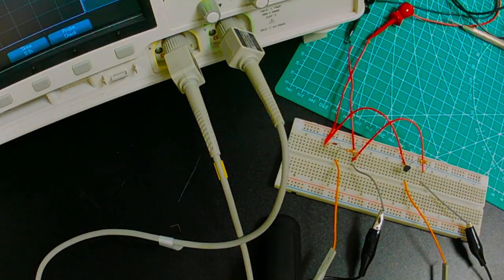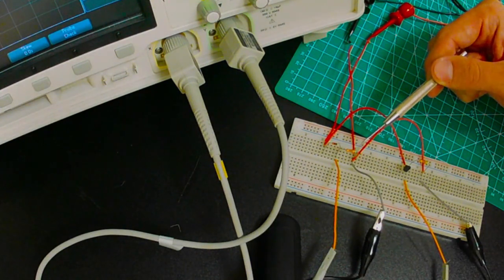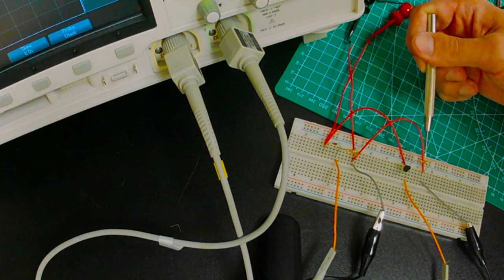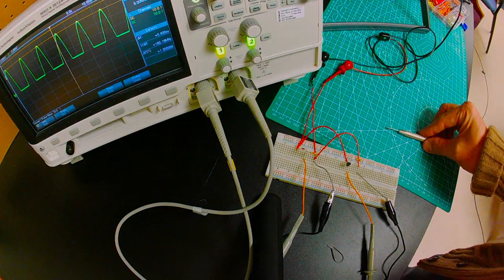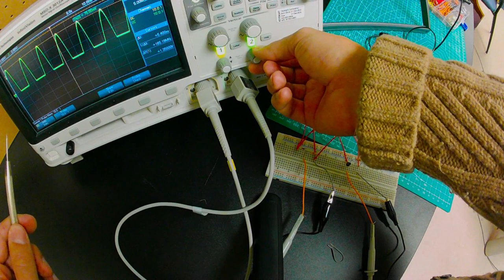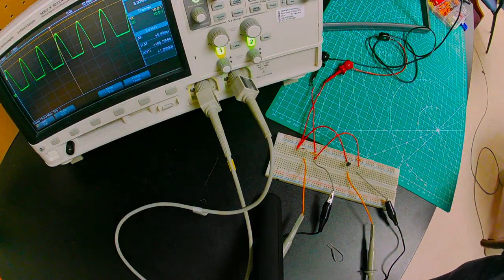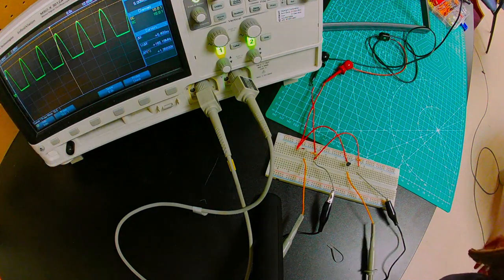So here's my circuit. Here I've got my diode, my resistor load, and it's hooked to a 60 hertz sine wave. Here's my bipolar junction transistor and also my 1000 ohm load. And let's take a look and see what our current result is. Well, it's a substantial overlap. You can't even really notice these two waves, but there's two there. I promise I can show you. They're almost identical. The green signal that we're seeing is the BJT, and there's a slight degradation. It's a little bit less than the diode.